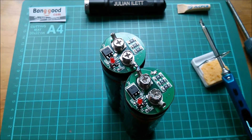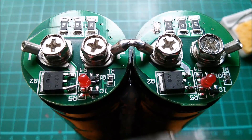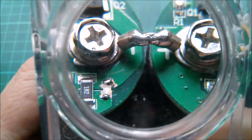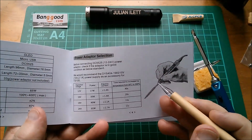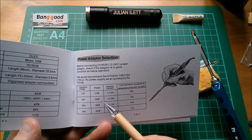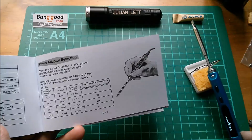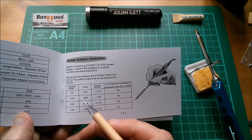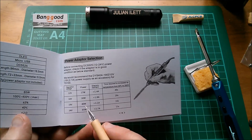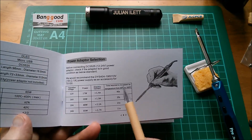Let's turn it off or put it in standby. If you want to see what I've done — that's it, sort of reflowed. Doesn't look quite as pretty from the other side. Now if you're shouting at the screen: yes, on 13 volts at the moment because it's not sunny today, you're only going to be giving it probably around 20 watts. This is only behaving as a 20-watt iron. If I gave it 16 volts it can deliver 30 watts to the tip, and from a 19-volt laptop power supply this iron can behave as a 40-watt iron.